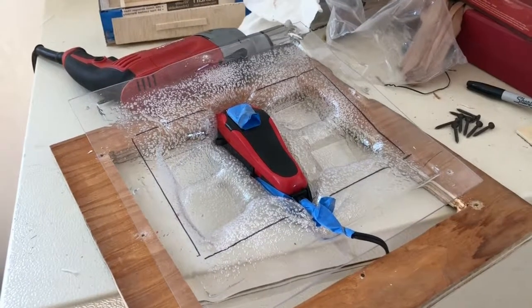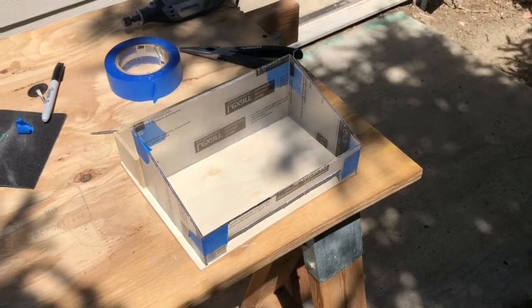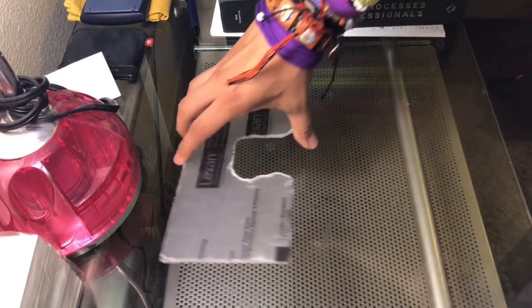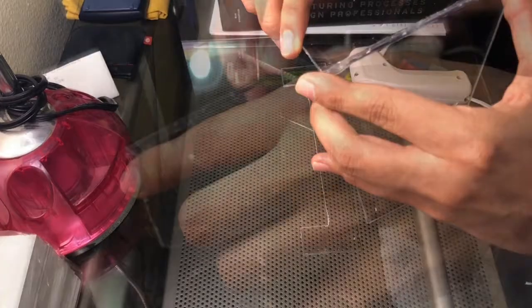Once the plastic cooled, I removed the components and cut the sheet down to size. To create the two side walls and front walls, I took measurements while referring to my blueprints and cut them down with the Dremel. For the back wall, I needed to cut a small cavity to fit the clippers. To do this, I traced the profile with respect to the thermoformed part. To place the walls together, I generously applied hot glue onto the edges.